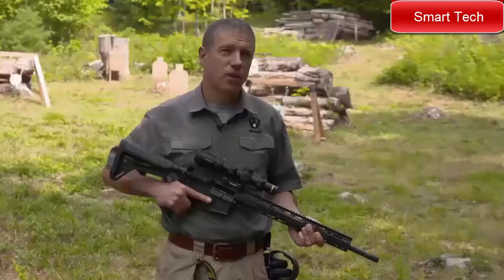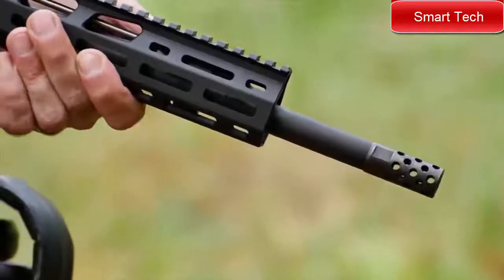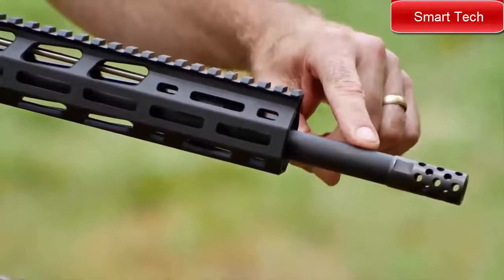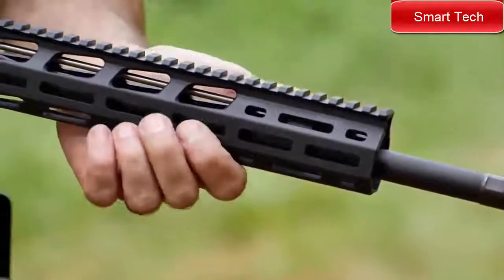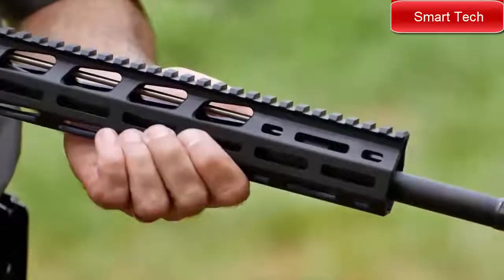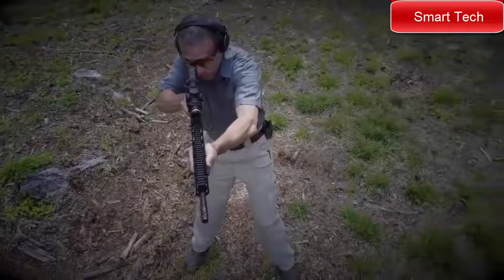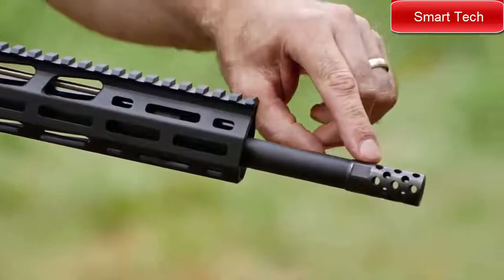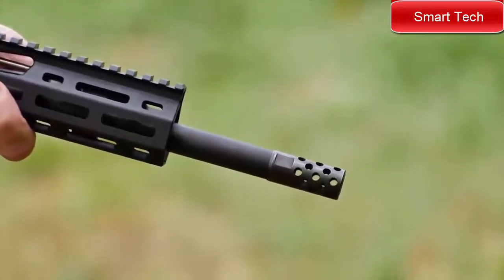A highly accurate build need not have a super heavy barrel contour. The AR-556 MPR has a .700 diameter in front of the gas block, a .750 diameter at the gas block journal, and the barrel contour is trimmed away behind the gas block. This lightweight contour contributes to fast and quick handling. The barrel is capped with a radial port muzzle brake that reduces recoil and muzzle rise, further contributing to quick handling.